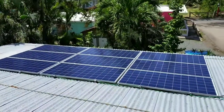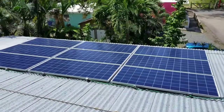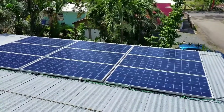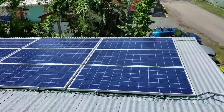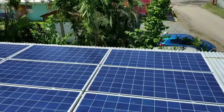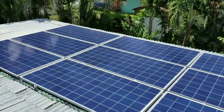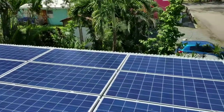And then look at this — this is my solar array, which consists of 9 poly panels, 320 watts apiece. They're in series-parallel, strings of three, pumping about 100 volts on each of the three strings. From here, they go down to a combiner box.